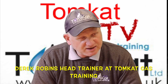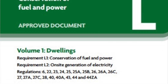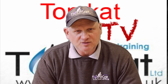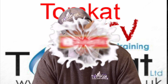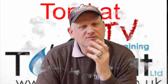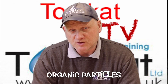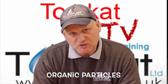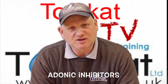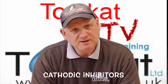The changes to Building Regulations Document L on the 15th of June 2022 have now incorporated BS 7593:2019 on testing central heating water when we install, service, or repair central heating systems. There are three different types of inhibitors: organic particles which bind to the metal to stop it corroding, anodic particles which stick to the surface and give it a protective layer, and cathodic inhibitors which bind with hard water salts to form an insoluble layer.